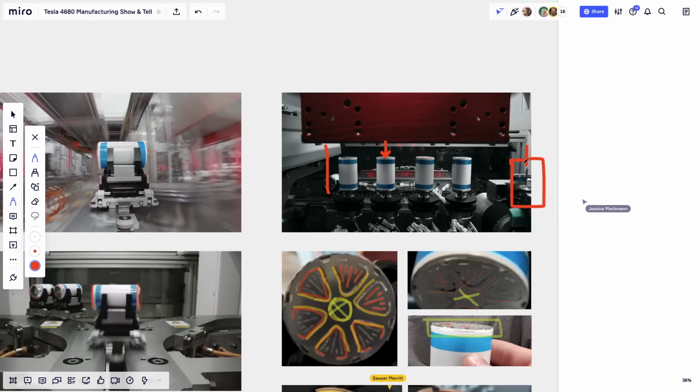Well, this needle, like this is a puck. So it's basically called a pin puck, and the jelly rolls are placed on top of it. It goes through the hole that we saw that was left accessible on the anode side, and it doesn't go all the way up. If I would draw it on this one, it probably stops about here, in the jelly roll.